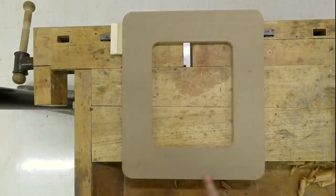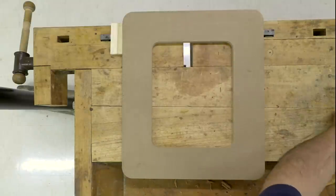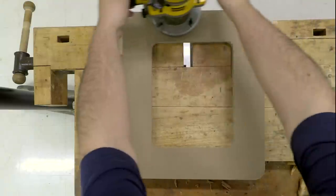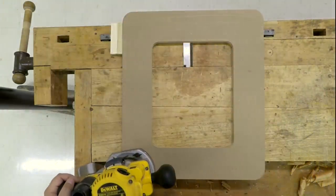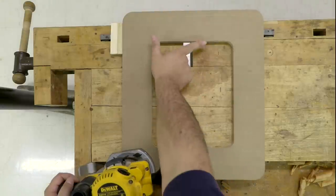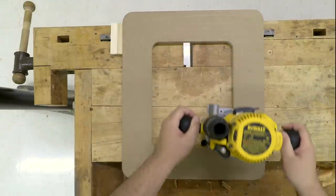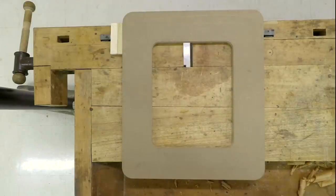If you're cutting on the outside of a piece, left to right works really well. But if you're cutting on the inside of a piece, we put our thumb down and we can see that we need to go the opposite — we need to go clockwise. So quite honestly, every time I'm routing a profile, I put my thumb out and remind myself which direction to route. On the outside, counterclockwise. On the inside, I'm going clockwise. It's worth taking a second and reminding yourself what the proper direction is.